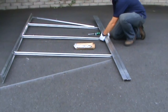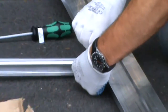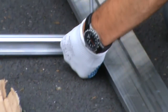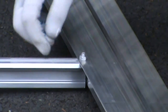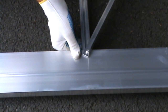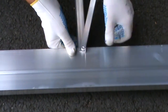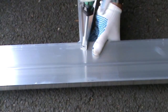Fix the built-in base sill to the middle glazing bar by pushing the bolt through the hole in the sill. Make sure it is tight down to the base. Position the built-in base section on the outermost glazing bar. Before you put the nut on, place the angle tie bar over the bolt. Arrange the angle so that in each case the flat bit faces towards the middle of the greenhouse. Place the nut on and fingertip tight.